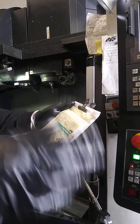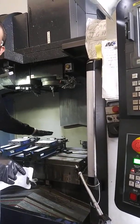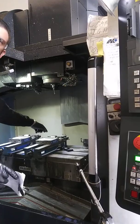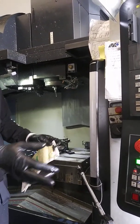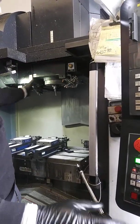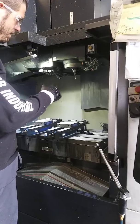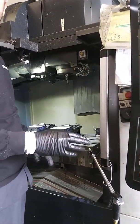T9, T10 - what are my thread mills? Touch off after T2 or T3. It doesn't matter whether you option stop it at T2 or T3. Or the best thing is to leave your fucking part in there and touch off on there. You know there's a thread mill stuck in there? Well guess what? I can leave that part in there, put a new one in there, and touch off on that part. Maybe you'll have to worry about it later. But if not, you gotta run T1, T2, and T3. Then push reset. So I'm gonna act like I just reset it right now after T3 just went, even though only T1 went.